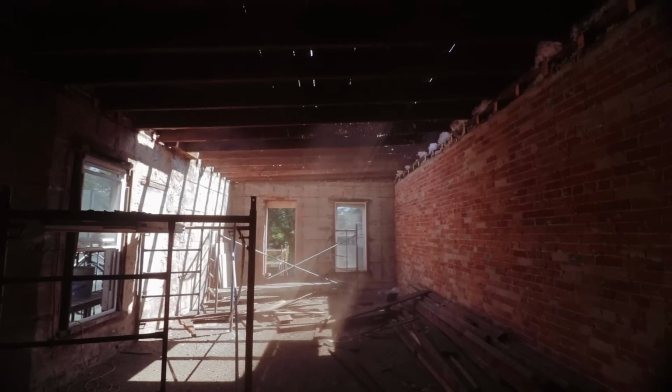So the biggest challenge for us was the rooftop deck. We knew the rooftop deck was terrible. It was sagging, it was brutal, it was old 2x10s. They were sagging about 2-3 inches in the middle, and we had to rebuild this whole thing. It made no sense to actually keep any of it. It made no sense to sister any of it.